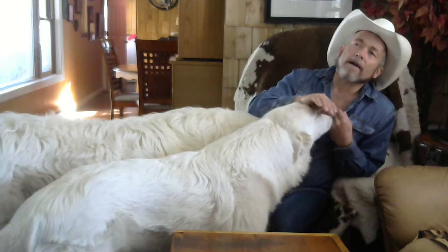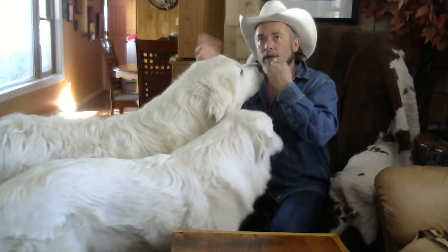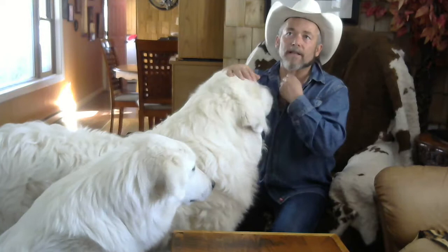This is how I do my fencing. My ground wire I keep about five to six inches off the ground. I keep it low so that the dogs can't get their heads underneath it and push up and sneak out without getting a shock like they're supposed to. My bottom one is six inches off the ground and that's a complete ground — there's no power to that line.